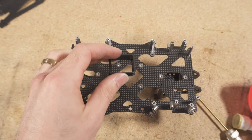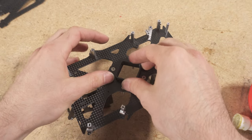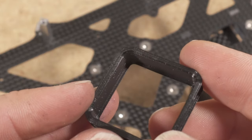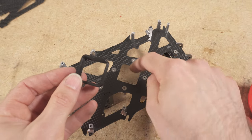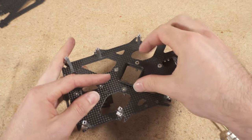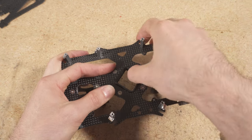Next it's time to install some 3D printed parts. First off is the fan grommet. Press this in from the top, but pay special note to the bottom lip — this prevents the little CPU fan from falling down into the drone. Because it's TPU, you can bend it and force it into the little square until it all clicks into place.